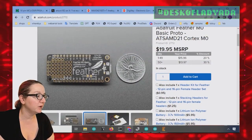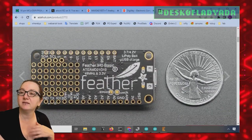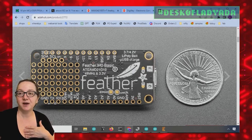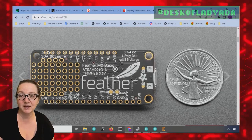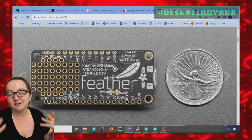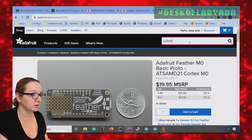To do that, what we use is a pogo jig. On the bottom you can see — zoom in — SWDIO and SWClock. I totally sympathize when people say they want to do step debugging with the Feather and realize they have to solder to these pads. It wasn't really designed for debugging — it was designed for programming in the factory. I load a bootloader on it, and then you never need SWD programming again. Some people want access to it for low-level development.